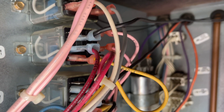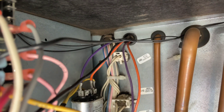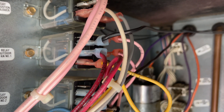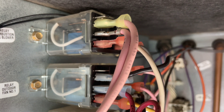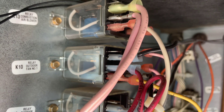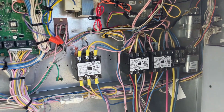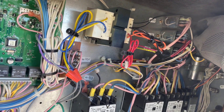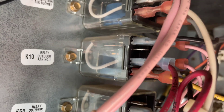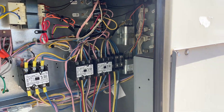The power in comes into the red, and when the relay is energized it goes to the black wire, which is connected to the fan motor. If we bypass that — connect the black wire to the upper terminal — it will be bypassed and the fan motor should start and get proper incoming voltage. The power is off. I've switched the black wire terminal from lower to upper. Let's turn on the power and test.